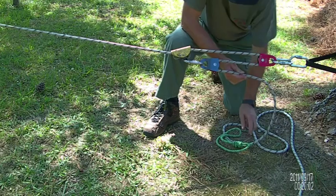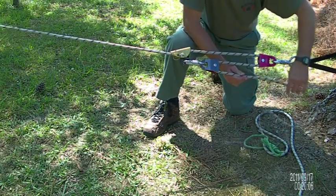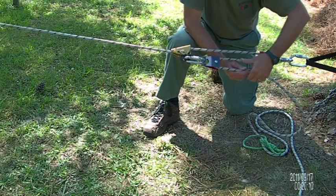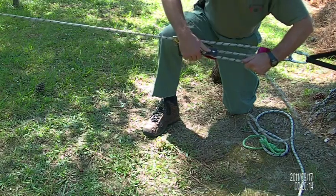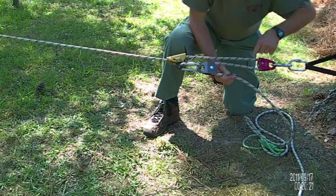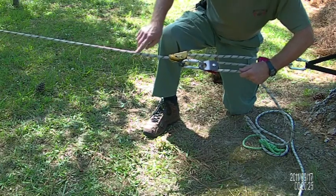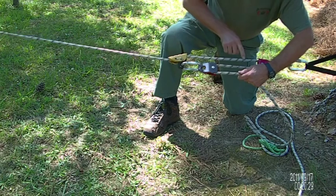The question is, where do I want to put this to capture the progress? This is my pull line. We don't want to put it on the pull line. If I attach the Prusik here around the pull line, notice what happens — I've got this tied up, it won't move out, it's locked me up. I can't put it here because this is just going to slide through the Prusik. So the only choice I've got is to chase down my haul line — see it coming in here? That's where you want to put the Prusik.